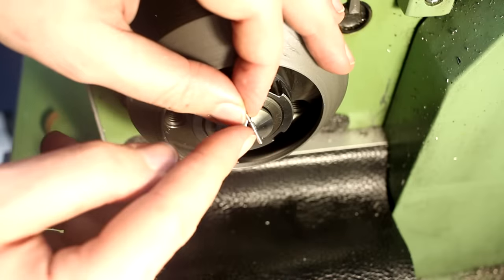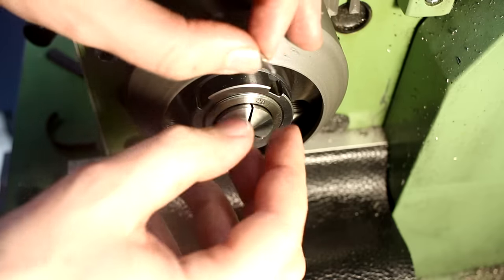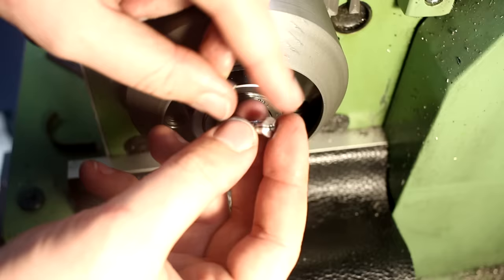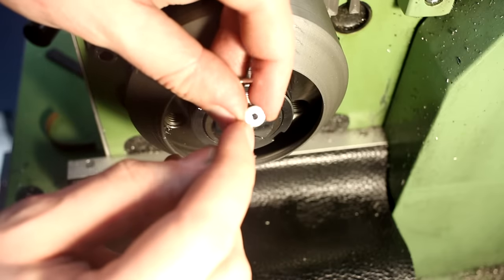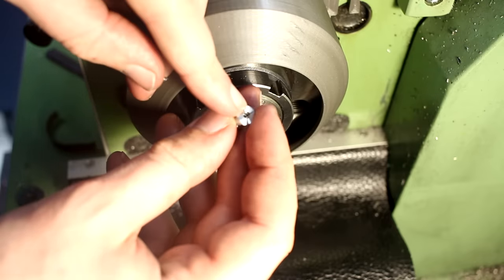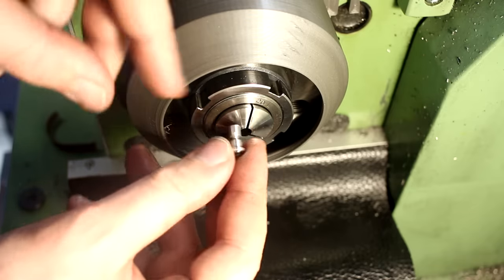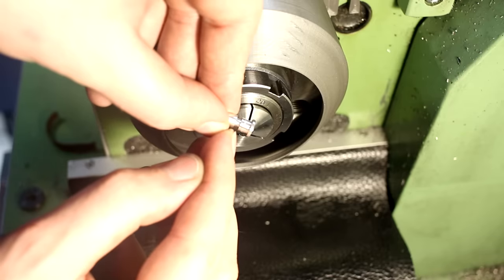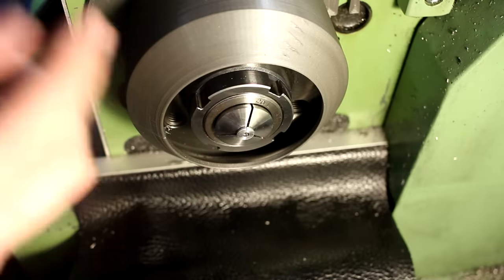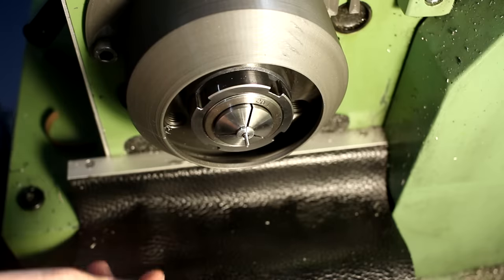Unfortunately, I was not able to film the second side. I completely forgot to film one part, but I can walk you through. Once the parts were parted off, I made an aluminium sub-collet, which has the contour of the part with all its steps machined into it, bored into it, and then I slit it with a small slitting saw 3 times to make it into a functional collet. And I turned a groove in here to make the flex easier. The way this works is, it goes in a collet, the sub-collet is in, the part drops in, then I can clamp it.